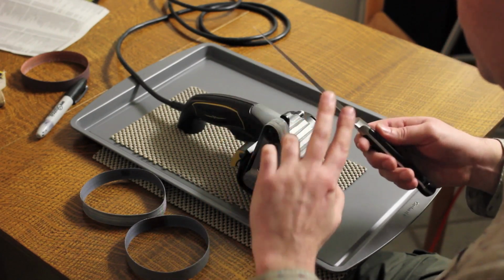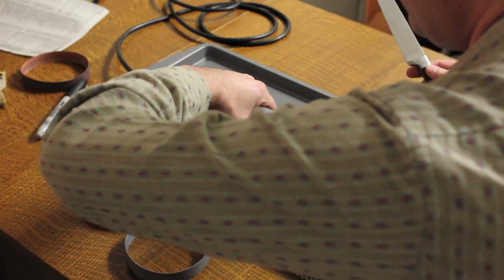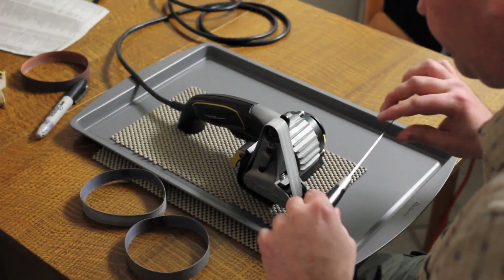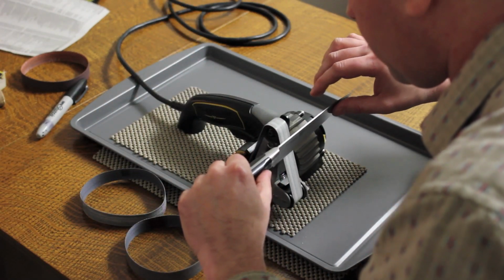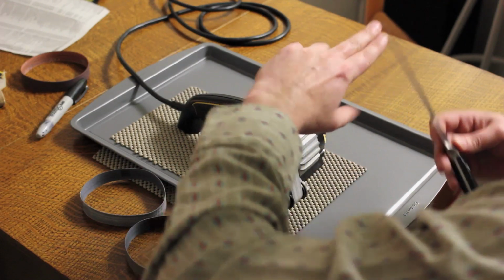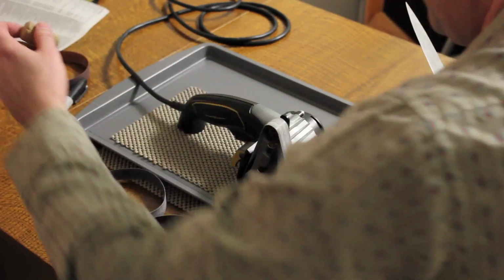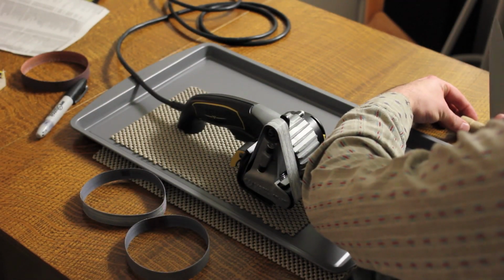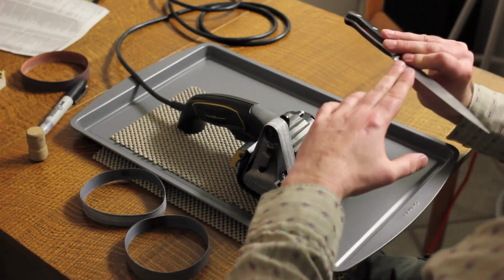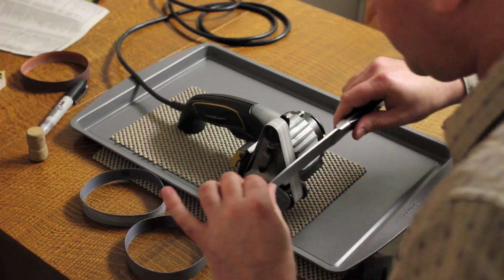All right, I'm thinking this is real close. Let me do some back and forth deburring passes. I'm going to turn this machine down to the slowest speed so that I'll deburr nice and smoothly. It's kind of strange. The cork's really revealing. Sometimes you think you've removed the burr, when in fact you've straightened it up. And when you cork, the cork tends to kind of tell you the truth.